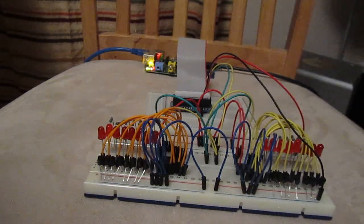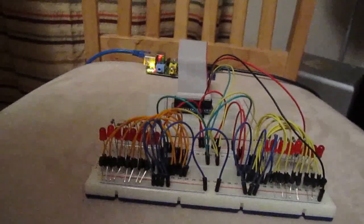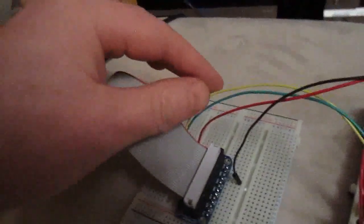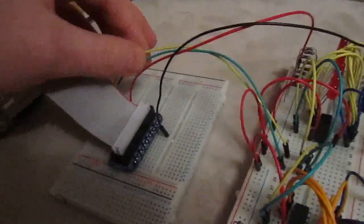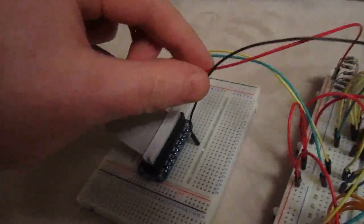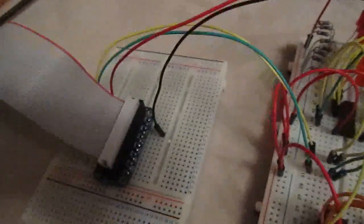They run on the I2C bus, which is just a little communication interface that works sending binary signals. It's just on 2 wires, so it's these 2 wires here. Everything that the signals go up and down to control everything, and then we've got the 2 power wires here, which is obviously a positive and negative.